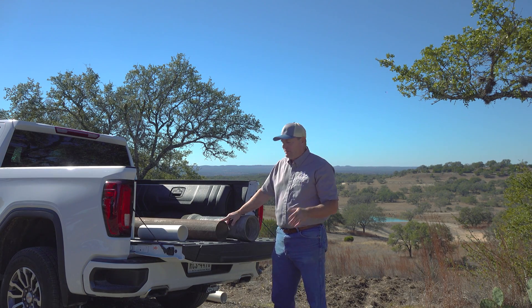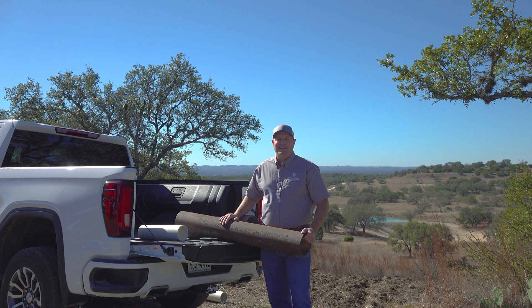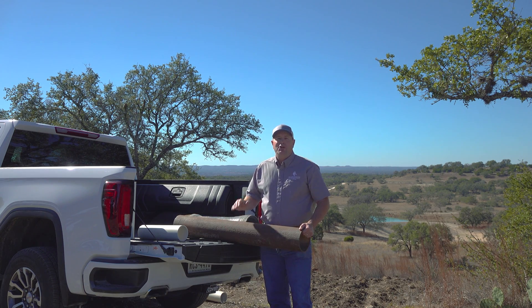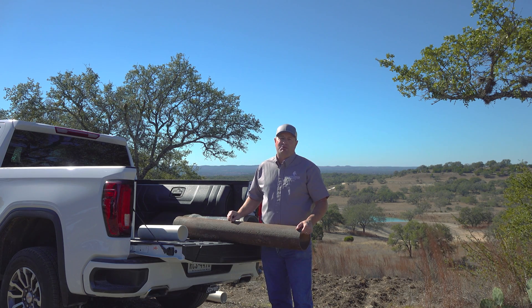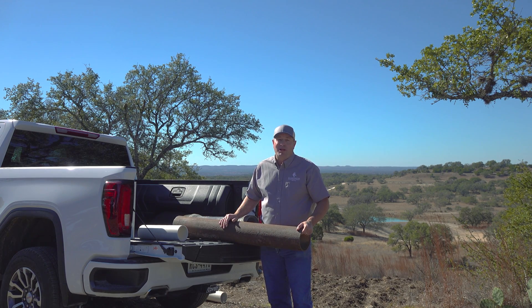The second most common casing is steel. Everybody likes steel — this stuff is crazy strong, you're not going to break it, and it handles heat better than any product on the market. But steel rusts, especially when it gets wet. Your pump is going to be pumping up little bits of this casing from day one, and that rusty water coats everything in an orange film. Now there are things we can do at the surface to minimize any damage, but there's nothing we can do about the fact that down in your hole your casing is rusting away. The longevity of this casing really depends upon the quality of your water, but we see it lasting anywhere from 20 to 50 years. And when it rusts through, you have to drill a new well.